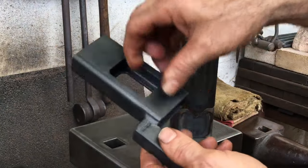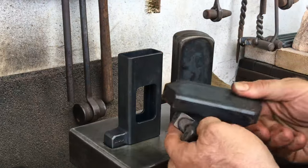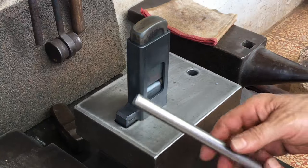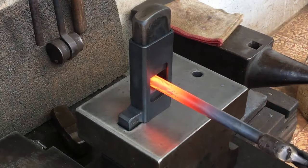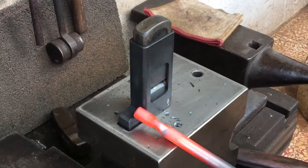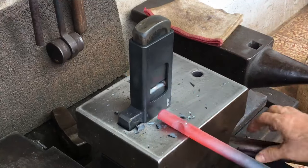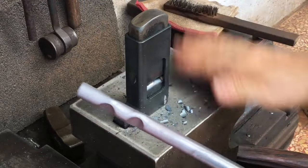This tool doesn't have a very big throat opening — I designed it for what I need — but later in this video you'll see that I run into a problem because of this and how I overcome it. I've switched back to using this 1050 hammer on my guillotine tool; I had switched to my YK-30 steel which is much harder, and I think that's another reason why my dies have been mushrooming much quicker.